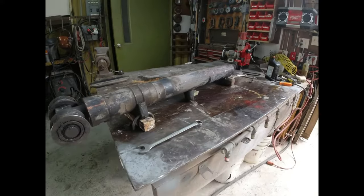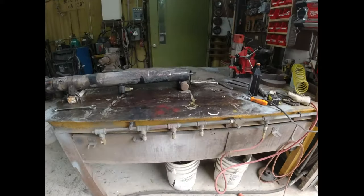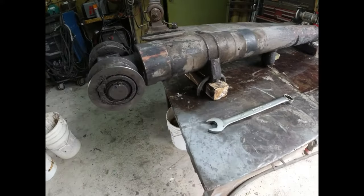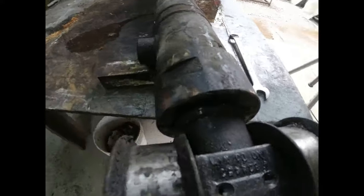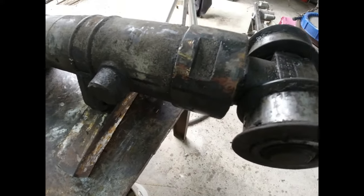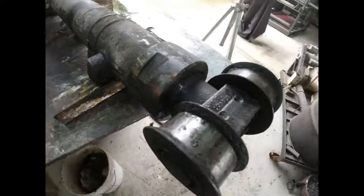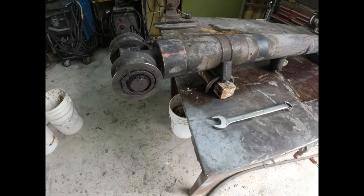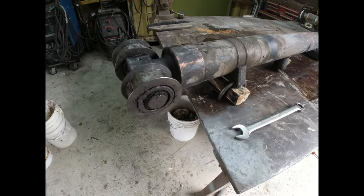The cylinder is on the workbench - it's a sturdy workbench, actually welded to the structure. I've got a bolt in the back through the workbench, a U-bolt up here through the cylinder and under the workbench with a plate. I think I'm ready to apply torque to this cap. It looks like it's bronze, which tells me it can't be too tight because it's not hardened steel, but I don't have a wrench to fit it. I need to borrow a 48-inch pipe wrench or cut one out of steel and make my own.